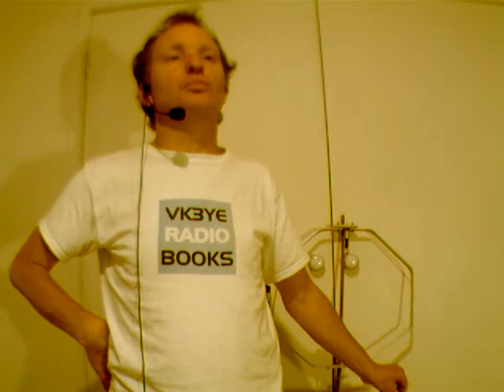Now, as to conditions, are they really that bad? Yep, DX over 3,000 kilometers is harder at this phase of the solar cycle, but there's still a lot of things you can do. You can still work DX with digital modes. I mentioned FT8 or JS8 can be very successful. There's a thing called PSK Reporter that you can look at to see where you're being received. JS8 has got some nifty features where you can send commands to stations that can hear you and get an idea of what they are hearing. You can leave messages, have keyboard chats. There's all sorts of interesting things there.